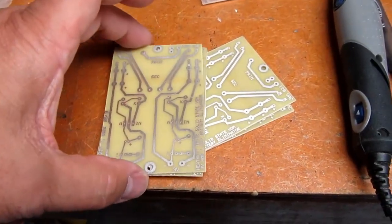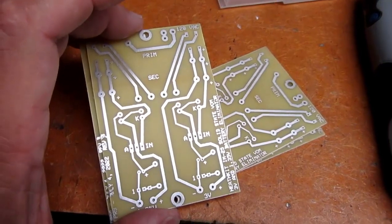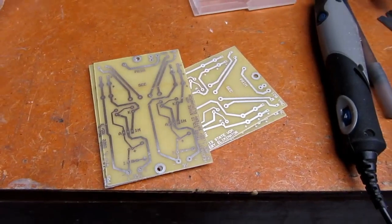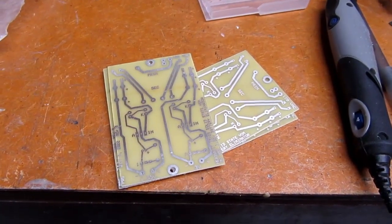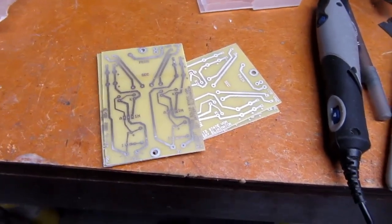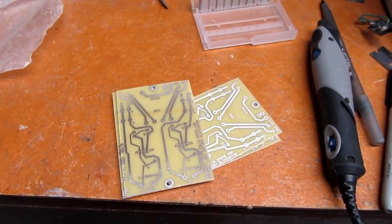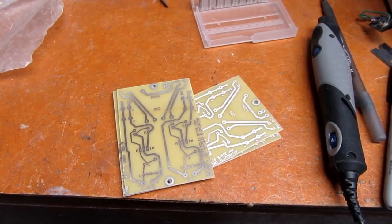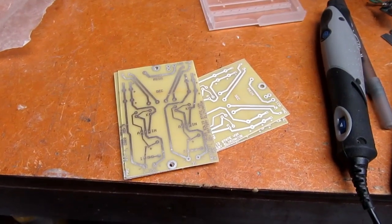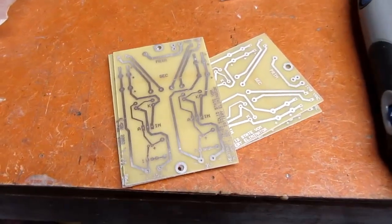I predict that this will be the method I use to make circuit boards at home now. It comes out pretty neatly, and I'm happy with the results, even though I did have to burn through a whole pack of the blue toner transfer paper doing experiments, many of which failed. And I have to use both the heat press for good toner transfer as well as the pocket laminator for the green film. I couldn't get just one machine to do both properly.